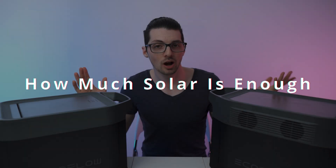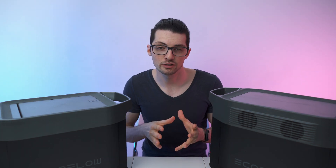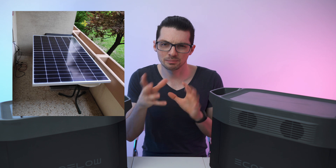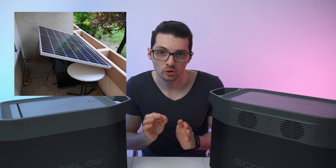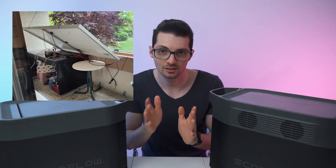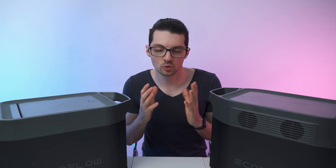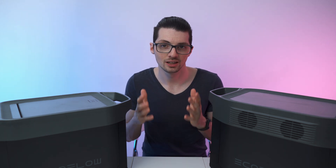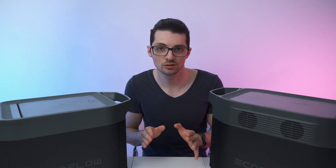Now let's move on to the solar panels. How many panels are enough, or rather, how much wattage do you actually need? In my case, I had a 375-watt solar panel inside my balcony area, and this only produced around 0.4 kilowatt hours per day on a sunny day — which is way too little. So if you're also in a really bad situation like me, one panel is definitely not enough. If you have a garden or an outdoor space, it might do, but I would still suggest aiming for around 800 watts of power.